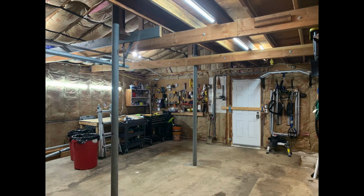Alright, so that temporary wall you briefly saw in the last video clip was built for the sole purpose to support the roof when they removed those gray metal columns that are smack dead center in the middle of the garage, the lolly columns. It's a really long stretch from the left side of this picture all the way up on top of the loft for the roof rafters. So those are supporting some of the roof.